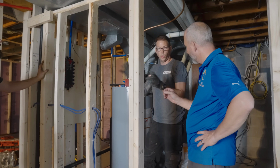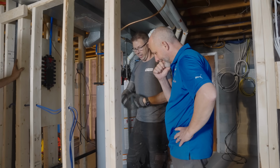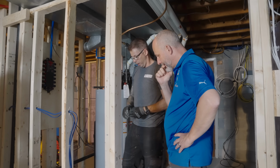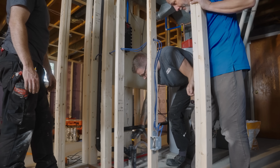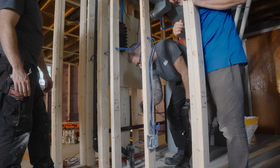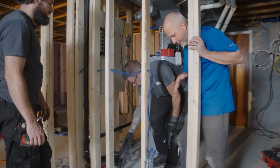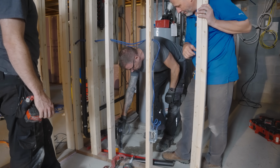So ultimately what ended up happening here is as we're trying to do our test, the test is not holding. So air is being bled from somewhere, and we're trying to find out where. A few weeks ago when we did our underground test, when this piping wasn't on, it was capped and ballooned, and we ballooned the floor drain, which is just over there, because it's an open port and we want a place to pour water in buckets. So now we come back and these lines are inside the pipe.